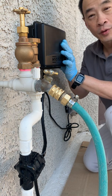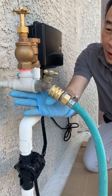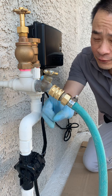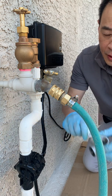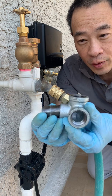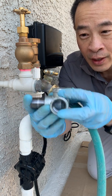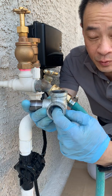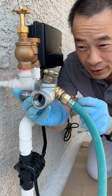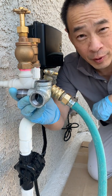So what we're going to do is put a water hammer arrester here in line with the water supply from the house. We're going to take the hose bib off using a nipple, put this funky right-angle three-way elbow in here, and on this end we're going to put the hose bib back so the hose goes out this way.